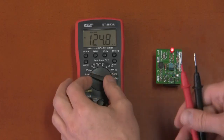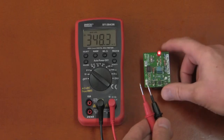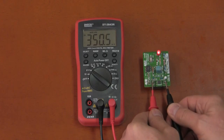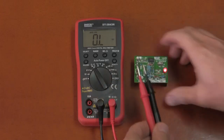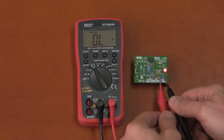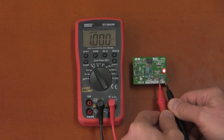Let's check the accuracy using a DMM check from Voltage Standards. On the 5-volt range, it's one significant digit out — well within spec. On resistance, the first resistor is 999.7 ohms. The meter is a little slow to auto-range but well within specification. The 9,999 ohm and 99,990 ohm resistors are also within spec.